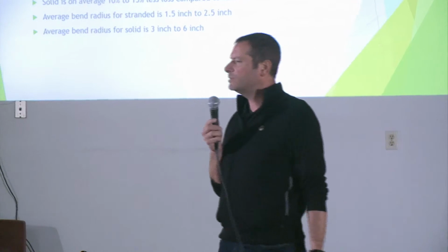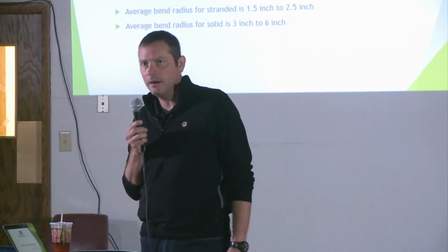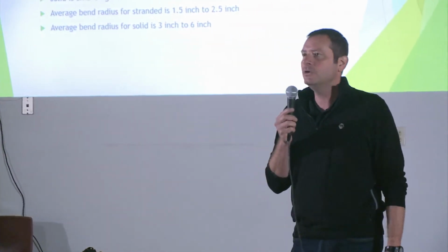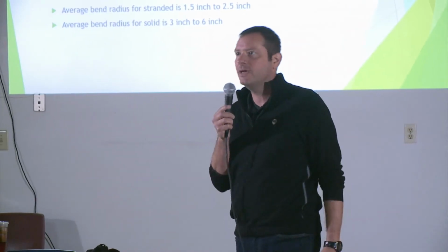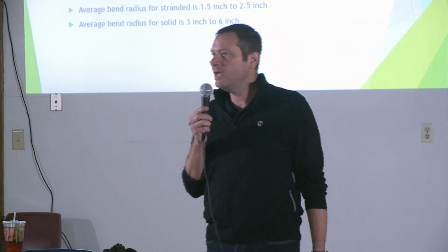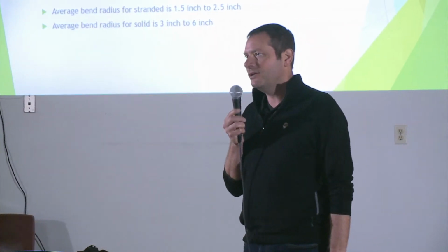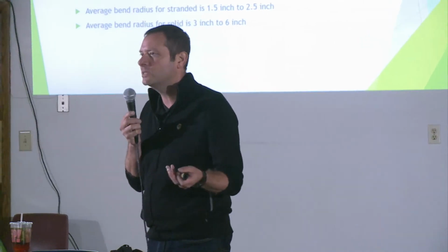and you do have, as it states here, about 10 to 15% loss on a solid center versus stranded being higher. And so you'd see the difference, like from an 8X size, you have a 240 solid, a 400 flex, you have a 400 solid. You're going to have lower losses, but if you're using a rotor, you want that stranded center conductor, so you want to be able to account for the slightly higher loss that's associated with it.